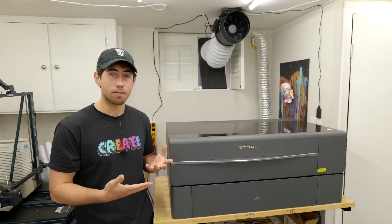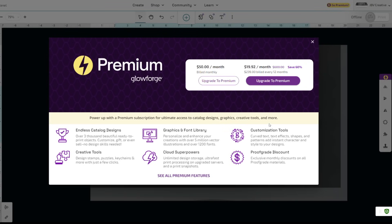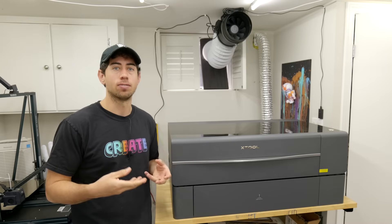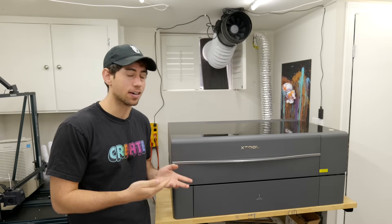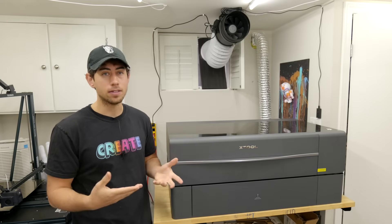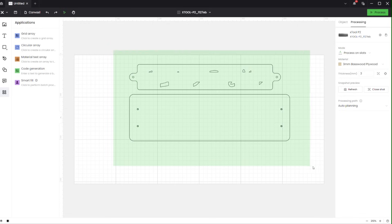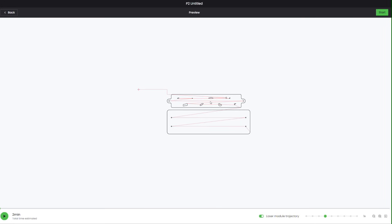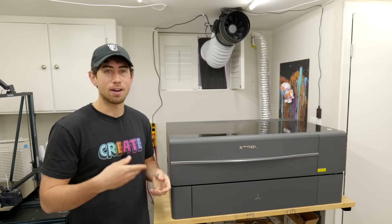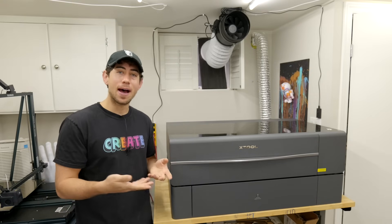The next compelling thing is the software. Glowforge runs on cloud-based software and charges a premium subscription just to access basic editing tools like flipping models horizontally. You also can't import DXF files directly into Glowforge software, and since I'm always exporting DXFs out of SOLIDWORKS, having to go through an interim software step is a huge pain. Xtool has its own capable local software. They've just released a new version that's faster and adds things like estimated job time. I drop a file in, hit process, hit go, and I'm running the machine. Glowforge's cloud-based toolpath planning sometimes took five minutes from hitting run to actually running the job — when you're testing cuts and trying to position something precisely, that time adds up.